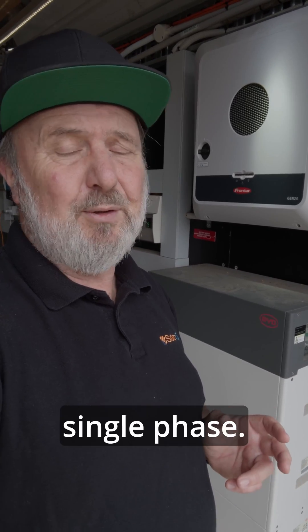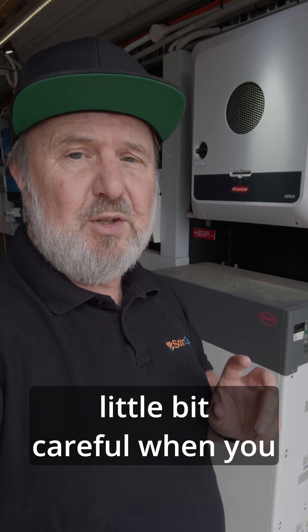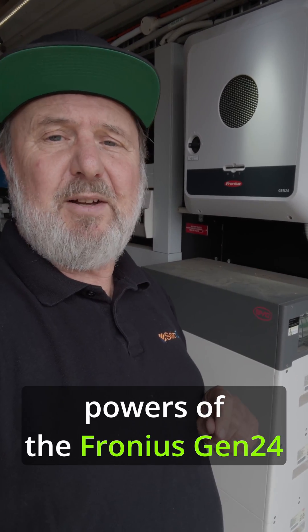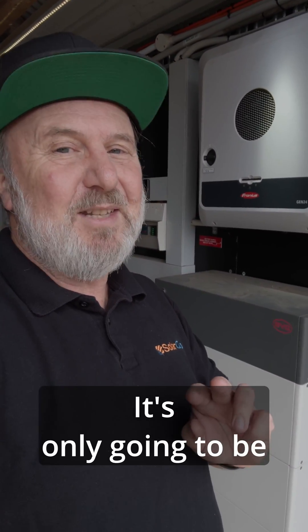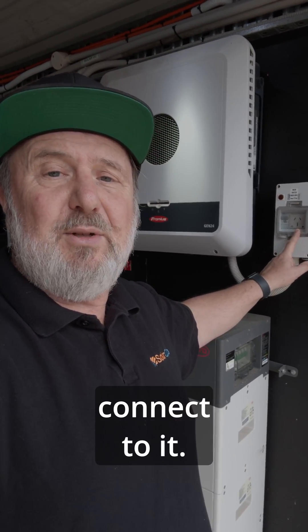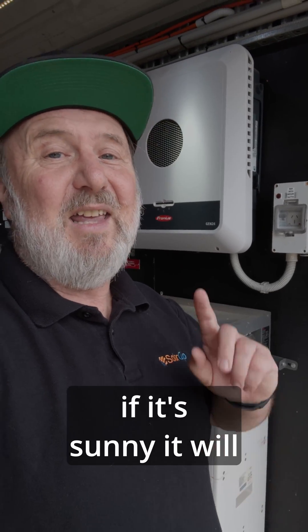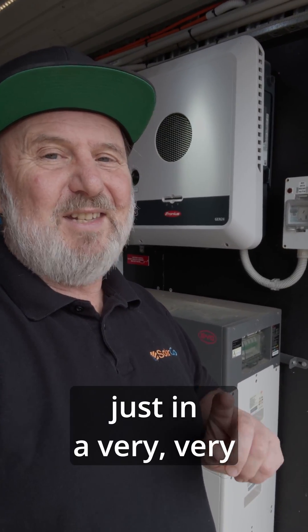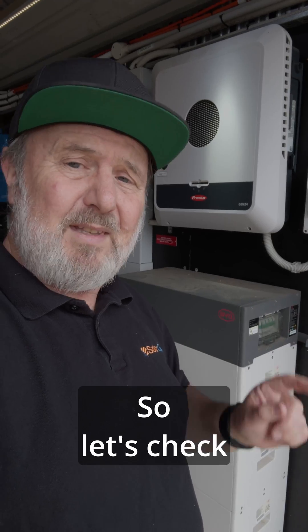This is a 10 kilowatt three-phase inverter, but it's only 3.3 kilowatts per phase. Most things you plug into a power point are single-phase; it's only industrial-level loads like big air conditioners or an EV charger that are three-phase. So you've got to be careful when choosing what you put on backup circuits. One special feature of the Fronius Gen24 is it can actually provide backup without a battery using a built-in PV point — a single-phase backup of 3.3 kilowatts — but you'd really still want a battery for power at night. These BYD batteries are stackable up to about 22 kilowatt hours with the full stack. A really nice system.